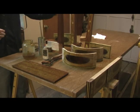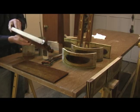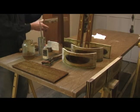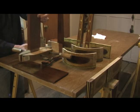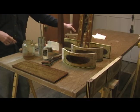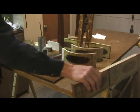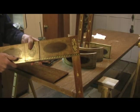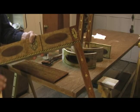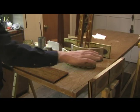That works well for several of the pieces. The rear apron — the fixed part — is only finished on one side so it can just lay flat on the bench. The movable piece to the rear apron is finished on both sides so it's held in this hand screw. And because of the configuration of this particular table there are no mortises in the front assembly, so I'm going to leave this section where the eagle is inlaid unfinished for now, and I can use that to grasp it while I apply the shellac. I'll hang it off the edge of the sawhorse in between coats, making sure I don't knock it off.